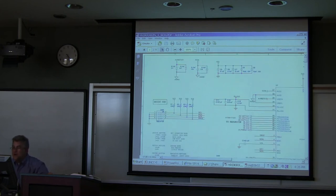And look, here's another one. Here's a couple more pull-up, or I'm sorry, decoupling capacitors. And notice that it's 0.001 microfarad. And why do you have different values of microfarads and picofarads, etc.? Why would you do that? Eliminate noise. Eliminate noise at various frequencies.